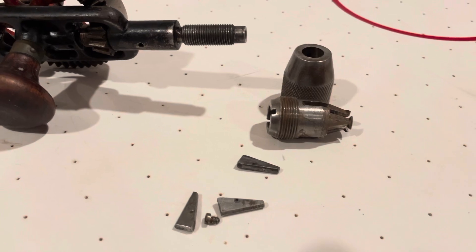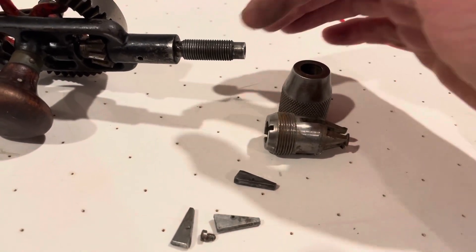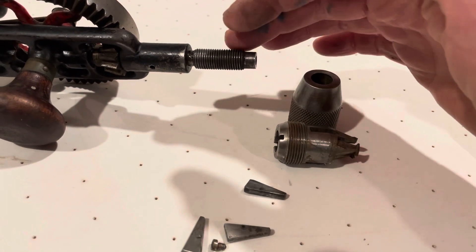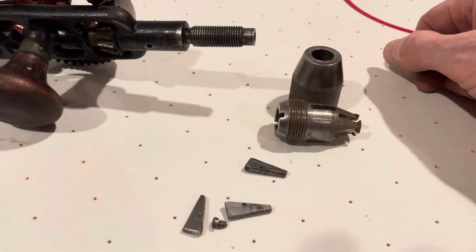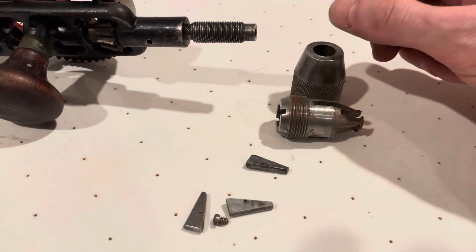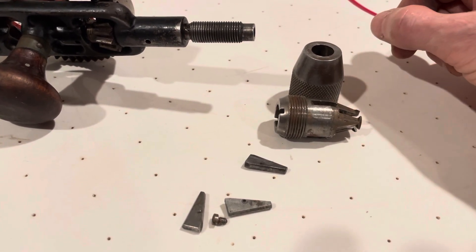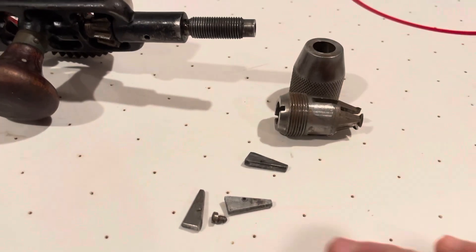The thread and diameter they used on the shaft for the chucks on the main shaft of the drill is pretty oddball — it's 22 TPI and seven-sixteenths in diameter. Good luck finding a tap or a die in that size. If you find one, let me know — I'd love to buy one.